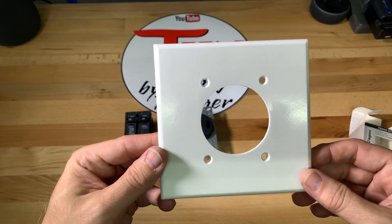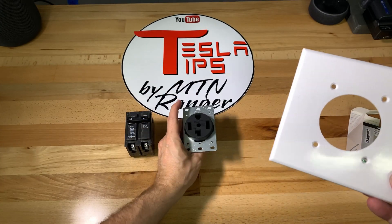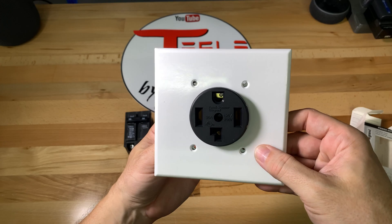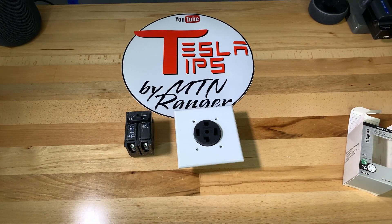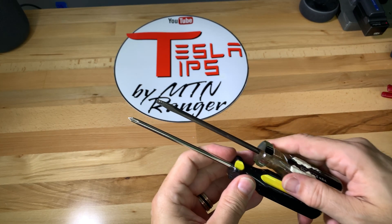This is the cover plate that fits over the outlet. I have noticed that NEMA round outlets can have different diameters, ranging anywhere from two to two and a half inches — this one happens to be 2.1 inches. Lastly, I have a new outlet box to replace the older one. I like this one since it has a built-in wire cable clamp. This will attach to the wood stud with four screws into the metal bracket.